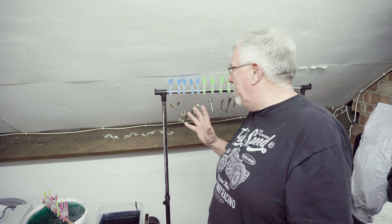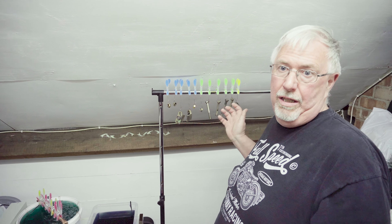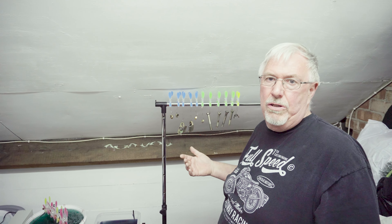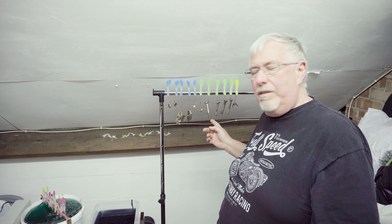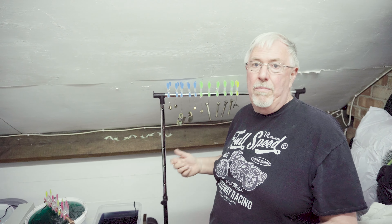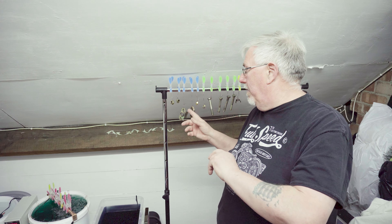I'm quite pleased with the results. They are a bit mixed — from a corrosion point of view I think they're going to be fine. They're not quite as pretty as some I've seen, and I need to get a bit more experience with the kit before I'm fully conversant with why I've got problems. I think with these longer bolts that don't seem to have taken it as well as the nuts, maybe I should have hung them from two points, or done them for longer. I'll experiment with that next time. But overall it's a great process and I'm really pleased I'm having a go at it. I really like the idea of doing bigger castings, because I think that would be really useful. Anyway, if you've enjoyed this, do subscribe, give us a thumbs up, and we've got other projects that should catch your interest. Thank you very much for watching.